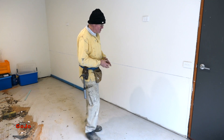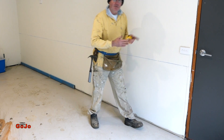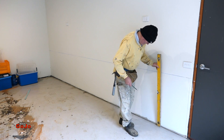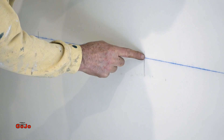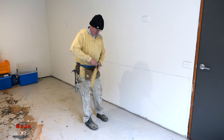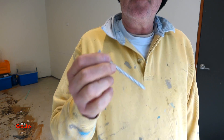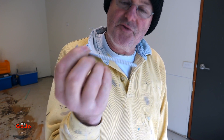The first thing to do as far as actual construction goes is put the cleat on the wall that will support the shelf. It's going to be cut accurately because it goes into the back of the architrave, and in between the architrave and the shelf will be a support the same width as the shelves. I want really good fixing of this cleat so I need to know my stud positions. This is a stud wall, and from the bottom I level up from where I know the studs are and mark off their positions. When you mark the wall, make sure you come above the line so that when the timber goes in place you can actually see where the mark is. If you're not sure of stud positions, grab your hammer — you can usually tell by the sound. When fixing time comes I'm going to use a bugle batten screw. I'm not just going to rely on nails because there's going to be a heavy load on these shelves. This is a 100mm, or 4-inch, bugle batten screw.